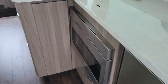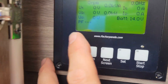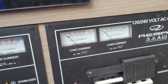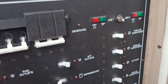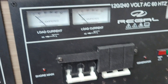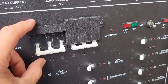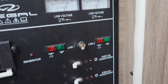Now you've checked everything and you're able to start it. You know your batteries are on. Come back to the panel — you've got no codes or anything here. You're gonna push the start button and let it fire up. For the sake of the noise, we're just going to use the shore power and pretend it's the generator. Turn everything off, start the generator, she's running. Give it 30 seconds to a minute — let everything warm up depending on the climate you're in. Then turn it on and make sure you've got voltage. Good on both legs, nothing should be on.